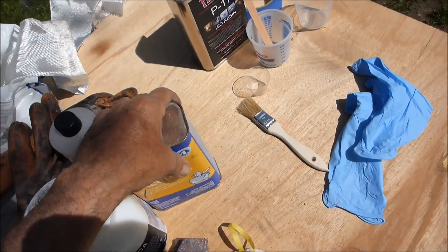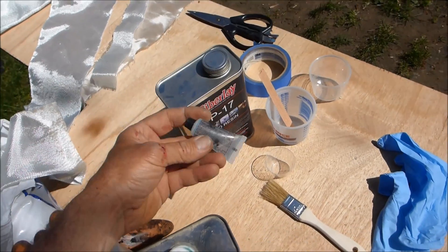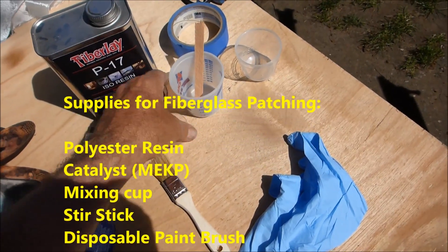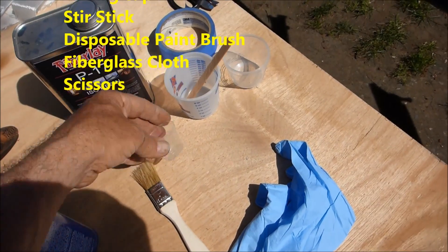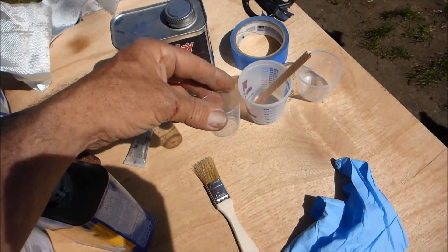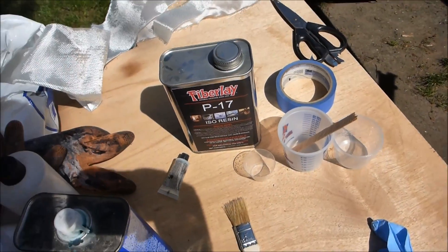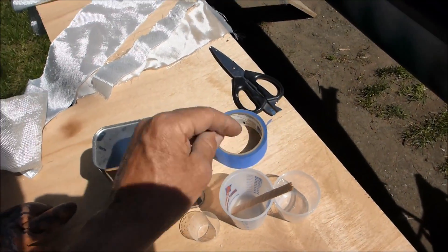You want to have a little resin — that's a quart-sized resin — and you want the catalyst hardener. Have some graduated containers depending on how much you're going to use. If you're using a couple of ounces, a small graduated cylinder works, but the important thing is that it's hard plastic and not a styrofoam or waxed cup. And have a little tape to mask off the area you want to keep the resin off of.